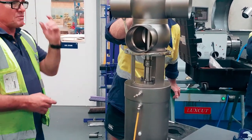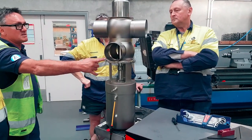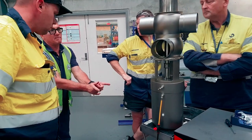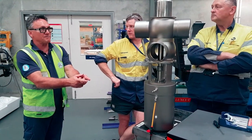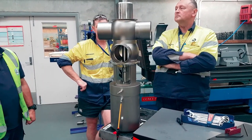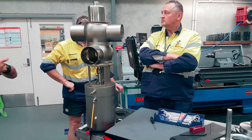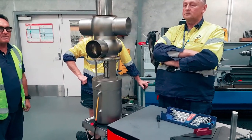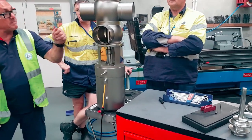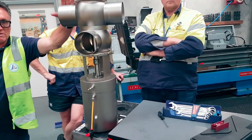Now, the other thing, if you're looking at that 10 newton metres and the condition of your clamp, is that those faces there want to be parallel. They don't want to be like that, and they don't want to be like that. Okay? And if they are, to get the effect of tightness, you've stretched your clamp. So what was your remedy to fix that when you lost it? Double clamps. Just a double saddle. Right. But again, if you looked after it and did the right thing, you probably would never have to do that. Hopefully. And if it continued to happen, then you'd have to be looking at whether it's the right application. Okay, so can we put this upper sealing element on there?